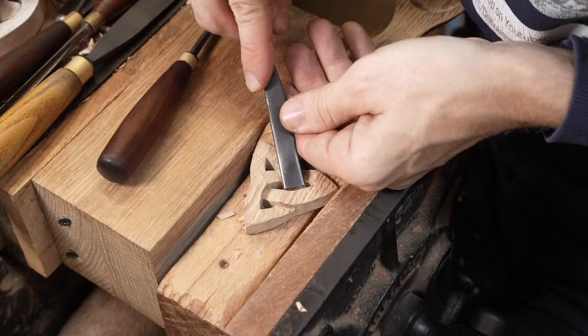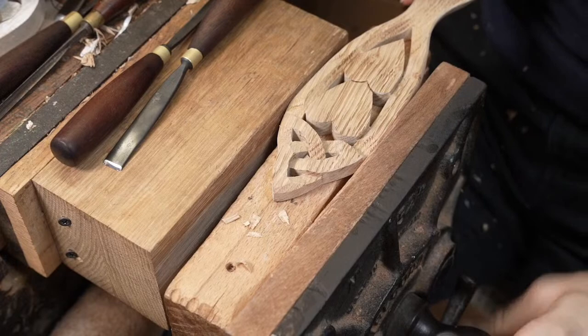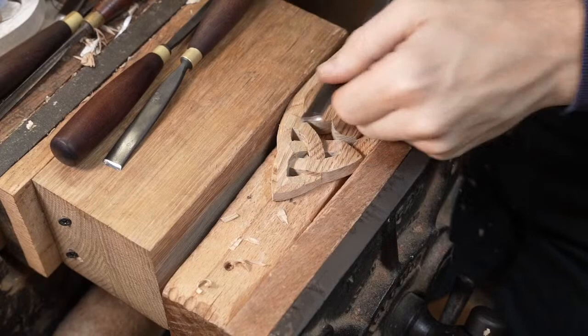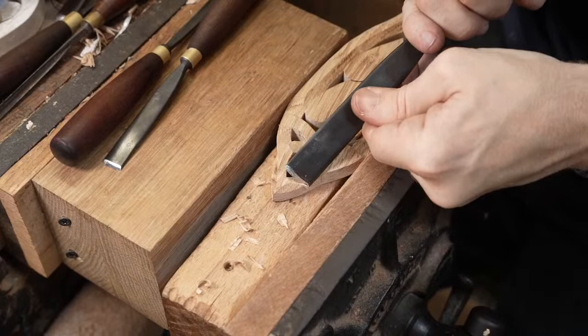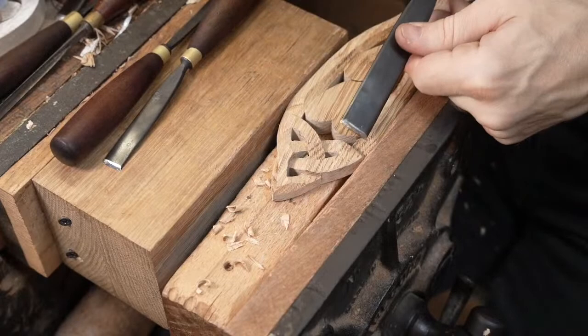So, finishing off now, concentrating on the finishing stages, we use our gouge, again going with the grain. Now, I've read the grain, that if I go in that corner there, we're going to get tear out because we're going past that critical point. So I will come back the other way. This one should be fine.